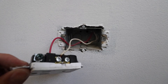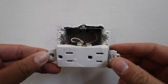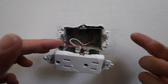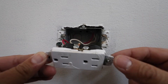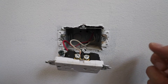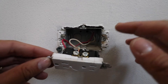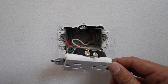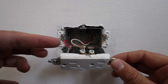You may wonder why this doesn't have a ground wire. Our junction box is metal, and the ground is actually the metal contact from the outlet to the junction box, which is the same as a ground wire. If you live in a state or municipality that uses conduit and metal junction boxes, you're not going to have a ground wire because it's grounded through the conduit. If your area does use a ground wire, you're going to have a green wire or unshielded copper wire that you'll need to connect on the new GFCI as well. If you don't have metal junction boxes, you'll have an extra wire that you need to reinstall on the new GFCI.